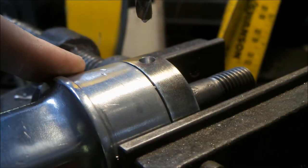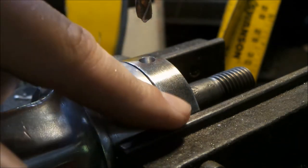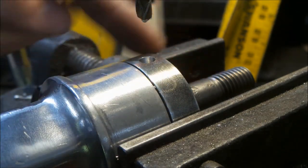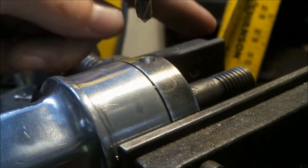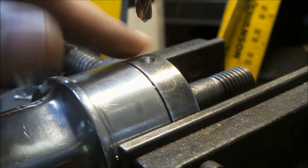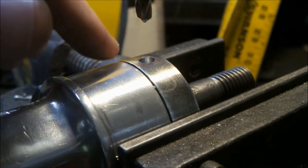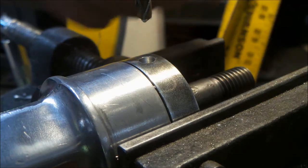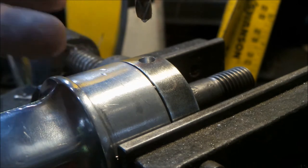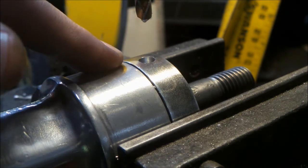Alright, so I just wanted to drop back quick here and make note of this old version of the grinder did not originally have a means of attaching a wrench to the motor spindle so that you can get the arbor nut off it. So what we did was we took a drill bit and drilled a hole into this collar, which is the backer for the grinding wheel, and that allows us to then put a wrench on here and get the nut off so that everything's not jammed together. It'll allow us to get everything apart.